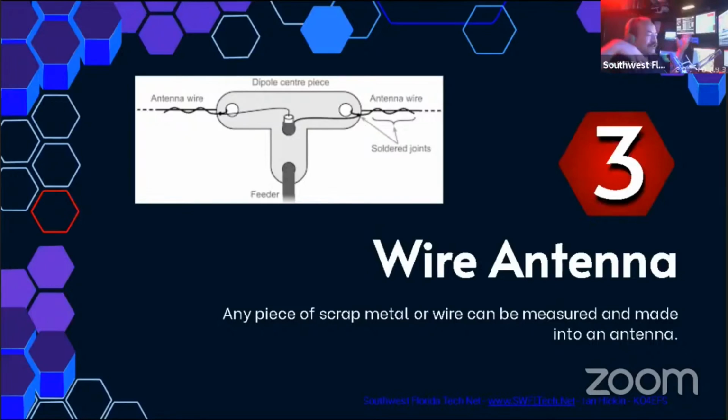So all I'm trying to show you guys is you literally don't need an antenna. You literally just need 2 wires that are separate from each other on the end of a coax cable. It can be anything. I've seen people take cookie sheets and drill holes in it and make separators out of those. After all, this right here is a wire antenna for HF. That's how it's made, pretty much. It's just an isolator that everything hooks into.